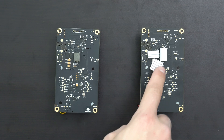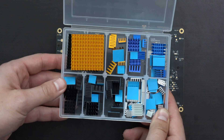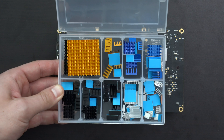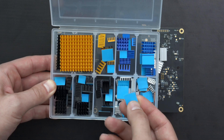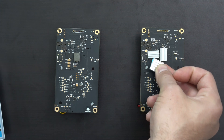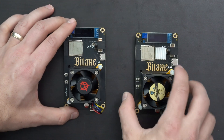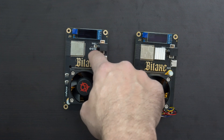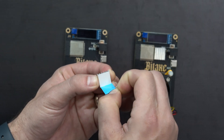To help keep things cool, we're going to start adding some heat sinks to the front and rear like this. There are all sorts of different heat sink kits you can get on Amazon and elsewhere. Copper is going to be your optimal material to use, but you can also use something like aluminum. These ones have double stick tape on the backside that you peel, and then you stick it to whatever you need — there's a thermally conductive paste so it sticks to the BitAxe and helps bring the heat over to the heat sink. Looking at the front side, I mounted it before based on photos I saw online, but looking through the thermal camera it's actually a little bit lower, so I'm going to mount it a little bit lower this time.